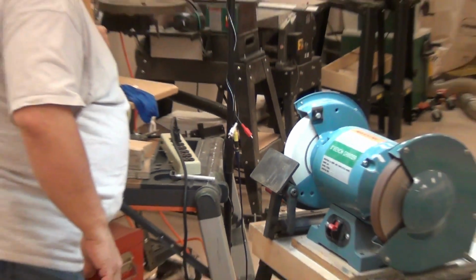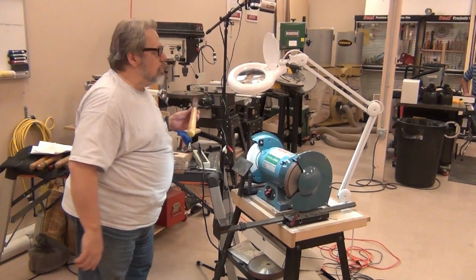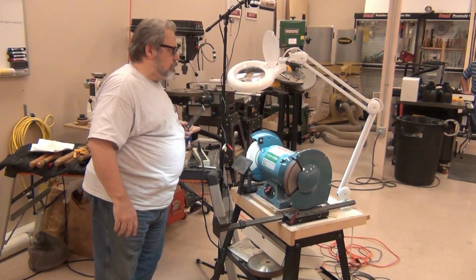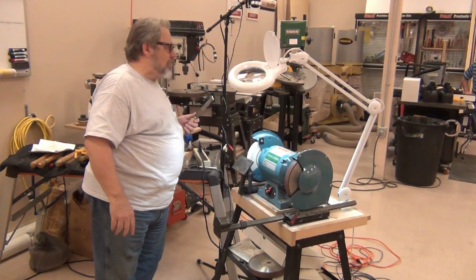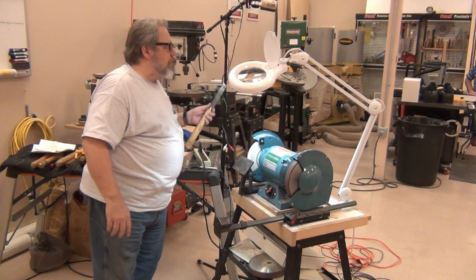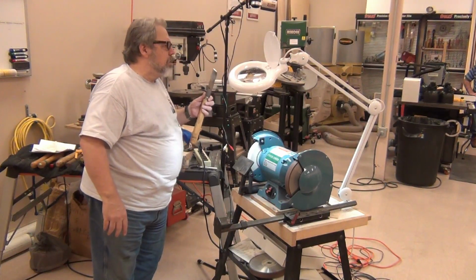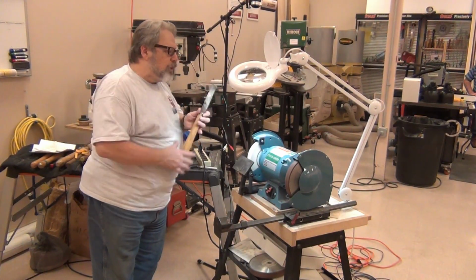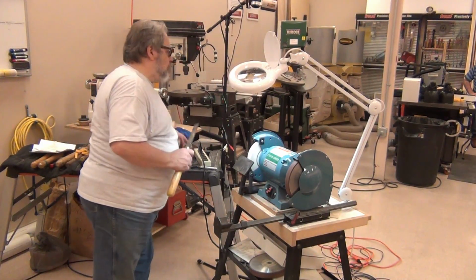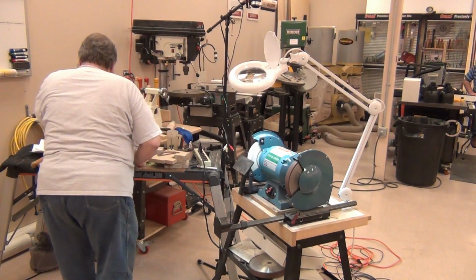The reality is a high carbon steel tool will end up sharper off a grinder than will high speed steel, okay? But that edge just won't last as long. But the other thing is what I was talking about before, the temperature on this is 500, 470. So if you start seeing sparks like that, you know you gotta be careful and have water definitely nearby. All right.